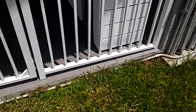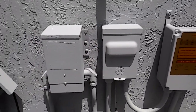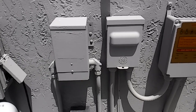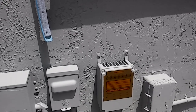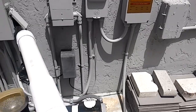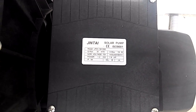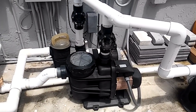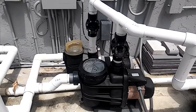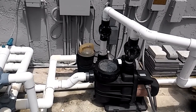The run goes right into a junction box — actually an AC disconnect box I got from Home Depot for about 20 bucks — with a 30-amp fuse in it. From there it's flex conduit going to the solar pump controller, which comes with the pump. The pump and controller were about $1,200. It's a Chinese pump called Jintai — a variable-speed brushless motor. Right now there's a cloud going over and you can hear it slowing down, and then as the sun comes back out you can hear it winding up again. One thing I really like about this pump is how quiet it is compared to my AC pump.